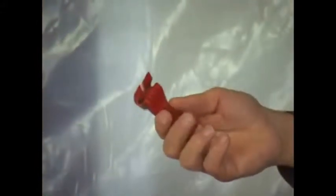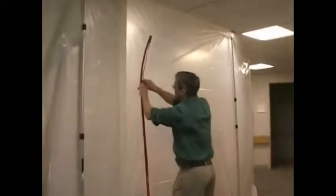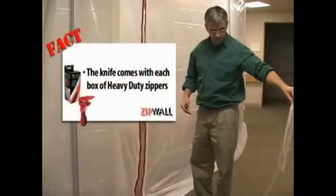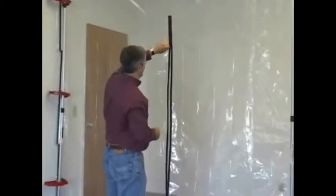Then cut the opening with the ZIP Wall zipper knife sheeting cutter. This special knife has two blades about three-quarters of an inch apart. Simply poke them through the plastic sheeting until the blades begin to cut, then bring the knife down, cutting a three-quarter-inch swath. This cuts a channel to keep the plastic from jamming the zipper teeth. This knife comes with each box of heavy-duty zippers.